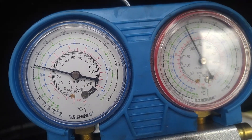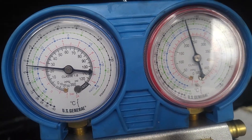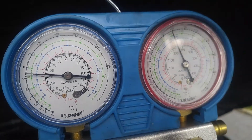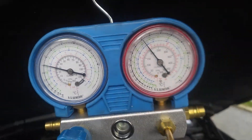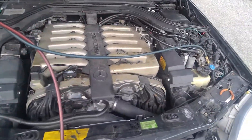Low pressure is about 30 but it drops below 30, and the air conditioner is really really cold. So it's about 225 high by about 20 low. This system is perfectly fine — it's been like this for years.